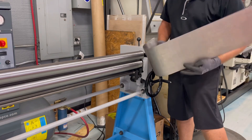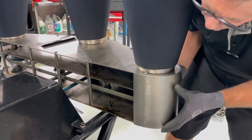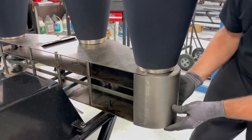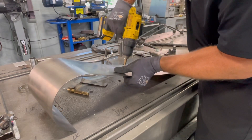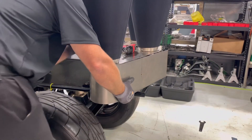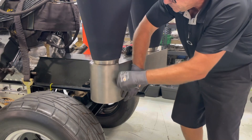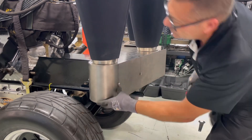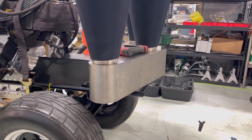I did not hit this on the first try. I ran back and forth a couple different times but I didn't figure you needed to see me walking across the shop. The fitment was pretty nice and it's going to be very well protected. The next step is to duplicate this for the other side. When drilling titanium, I start out with a very small bit, high speed, and then if I'm going to drill a hole I use a unibit — it cuts through titanium the best. Just throw away your other drill bits when doing titanium, a unibit is the thing to use. When I have a radius like that, I'll start on one end and just wrap it, working my way along to find hole locations. If you lay it all out at once with a radius you can end up a quarter of a hole off, so I tighten it on one end, pull it, and just do it that way — it generally works out pretty good.